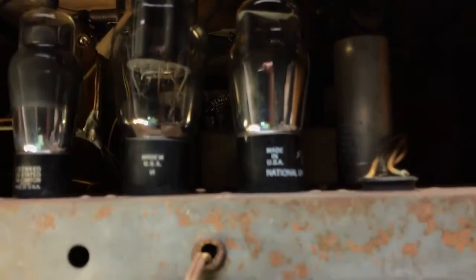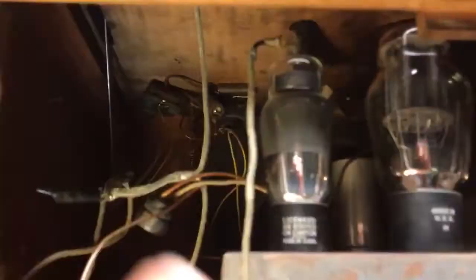So far so good. We'll have to do a part two on this. When you get it running: bridge the big caps — they were open — replace the coupling cap and the plate feedback cap because it was shorted. Everything else I left alone for the time being; the resistors are good, the caps okay. Put a new power cord on it first thing. I'll pull the top out, get to that network, rebuild it, then put it all together and see if the cartridge is any good — and I guarantee you it's not — and we will play some music.